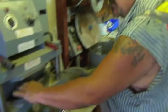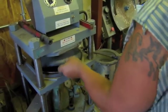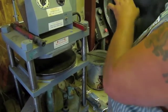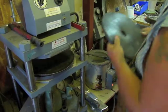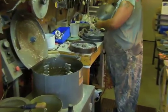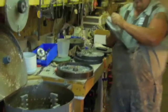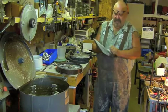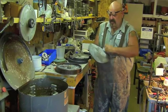Okay, this rubber. Make it nice and warm. Gonna punch out the center, and it gets very hot. I save those things. I don't know why I save them. One day I'm going to use them for something. Putting some of these exhaust. So here's the parting powder. Make sure the mold comes apart.